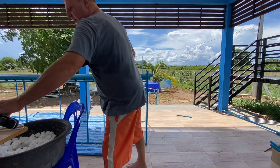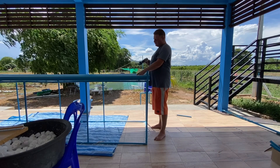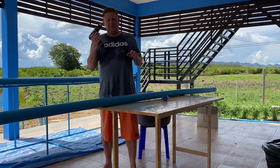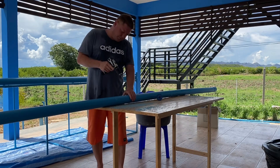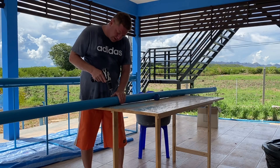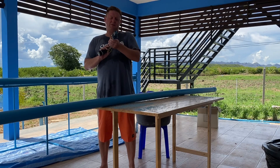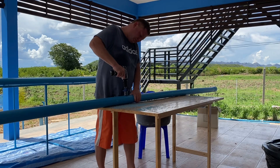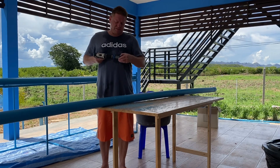To cut the holes, I've just bought this thing here - a hole cutter. So I mark these up. I pre-drilled them with a smaller three mil bit, and then I've gone through with this one here. So drilling these holes is pretty simple. I'm going to pre-drill with this one here because this one is quite thick - about six mil, this one's about three. So to go through initially, pre-drill with a smaller drill bit, go through them all like that. Then we'll use the hole cutter. Start going through. I'm not pushing too hard - I'm not going to get it stuck. You want to go nice and easy. There you go - through. Take that out, go on to the next one. It's that simple. We'll run through them all.